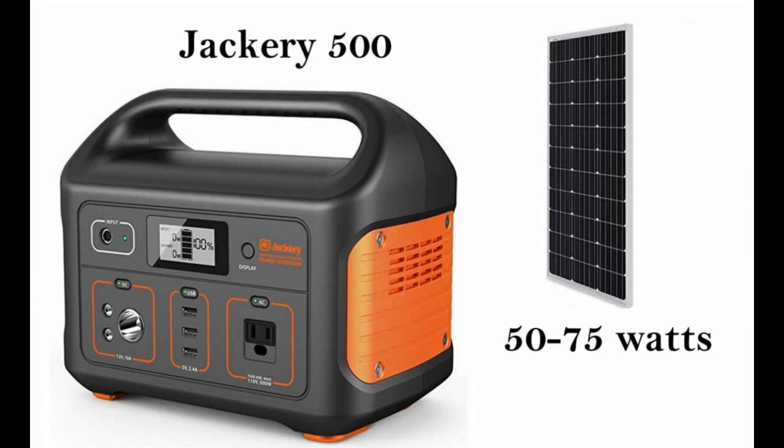It comes back to what they designed it for: one 100-watt panel, with voltages that fit the charging circuit controller, which was built to work with that one panel. You'll end up getting efficiency somewhere between 50 and 75% — you're never going to get 100 watts no matter what, because there is inherent loss with solar panels. That's why mine is getting around 55 to 60 watts, and with some better panels you might get 70 or so.